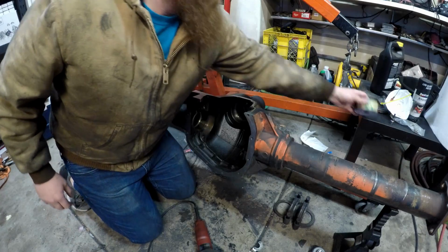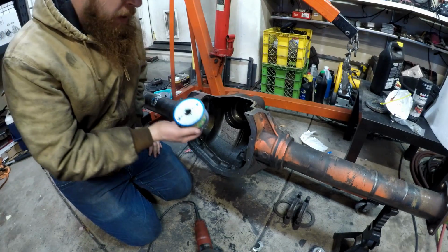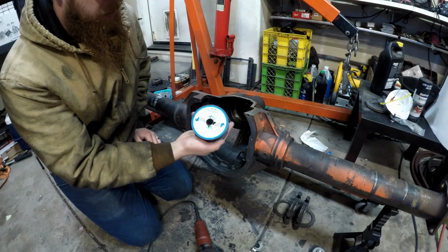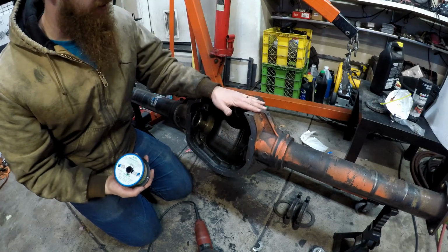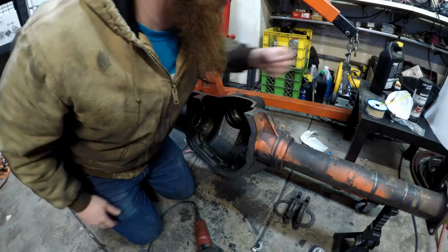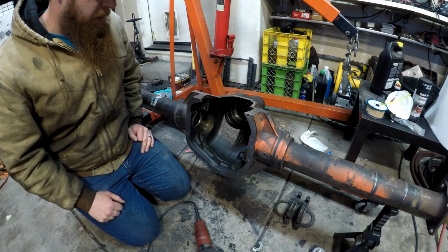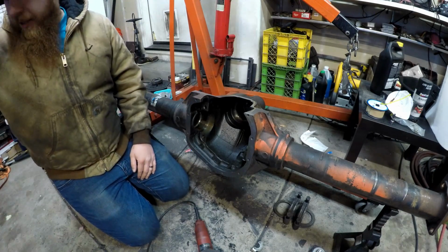But I do have my NI-55 wire. This is a nickel and iron mixed wire, and it's designed for welding cast or steel to cast. And they recommend you still preheat, which I'm gonna do. I'm gonna get my clown gear on and start grinding.